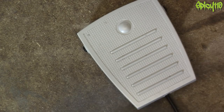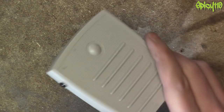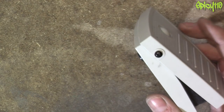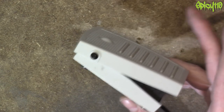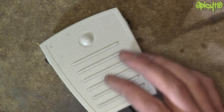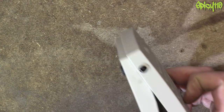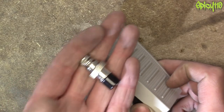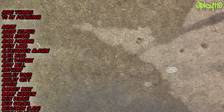For the 170-amp TIG welders you just need one of these connectors. I'm confident this will work with no problems, although at some point it might stick on, but I don't see why because it's a mechanical switch — I've just reversed the way it works. Nothing in there is doing a different job to what it was doing before. I might get a bigger pedal or make a pedal, but putting a normal switch onto one of these connectors gives you the ability to have a foot control — or elbow control if you wanted. There you go, that was an interesting little project that I thought I'd try out, and it worked.